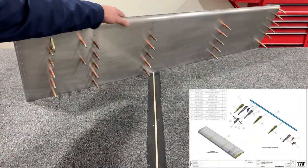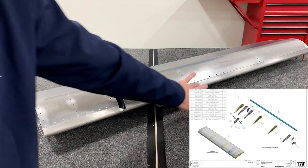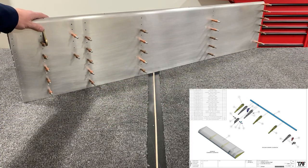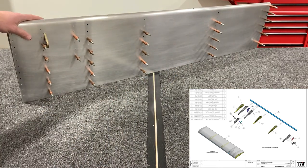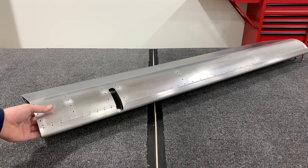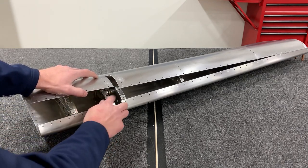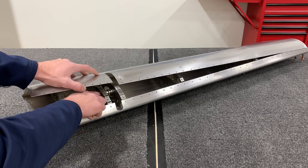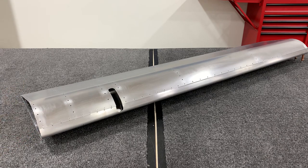Now I've got all the ribs clecoed into position from the underside. The easiest way to do this is to leave off your counterweight balance tube on the front — you're able to install the ribs much easier working with the aileron upside down. Start by clecoing everything from the underside, and leave off the front row of clecos along the whole thing so that when it comes time to slide the balance tube in there's a little bit of play. With ribs 2 and 3 clecoed and confirmed straight with the skin, we can tighten that bolt the rest of the way. Also leave off rib 1 so you have a nice opening to slide that counterbalance tube through.